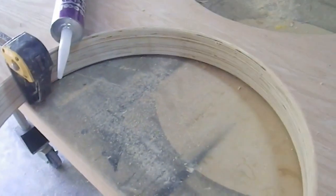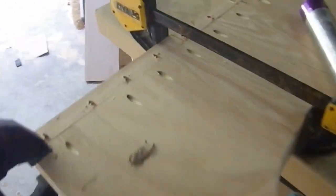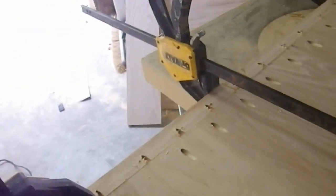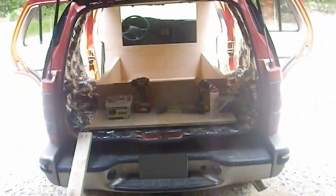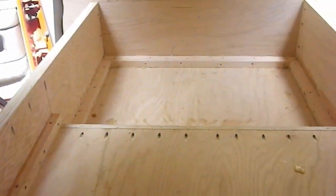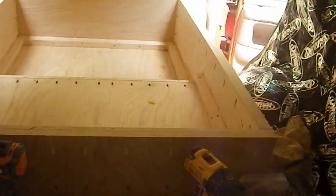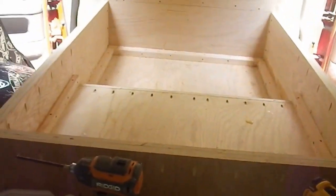This is all void-free oak. When I lost my cubic foot I had to get it back somewhere, so I've extended the baffle out an inch and a half to get back where I want to be. The next thing to install is one long center brace running all the way down the middle, with another brace that tees up and holds it. Then I can do some caulking around all the seams and load the baffle in, then build the side walls up to the roof.